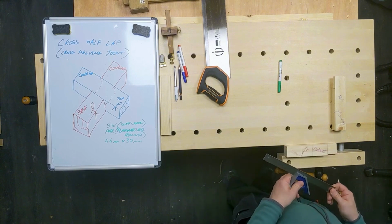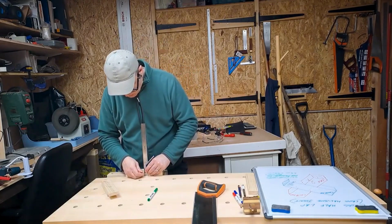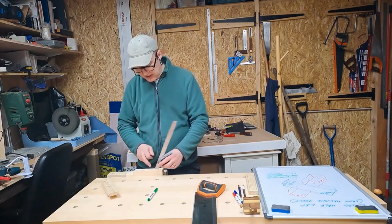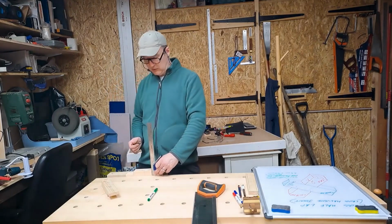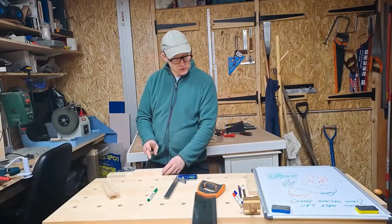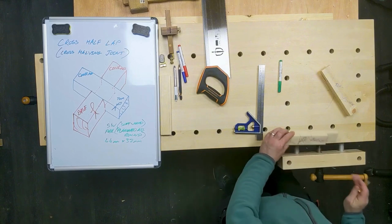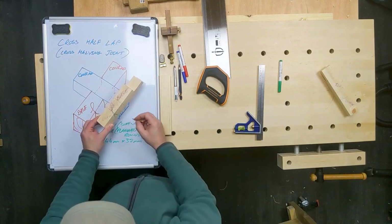Since it's in the vise, I'll leave it there. So you can see from the front that I don't have to move it around that much. And I want this to go just beyond halfway down here. The body of the combination square is on the face side now. That'll be halfway there, without getting marked. That one through there. I'll do this side on both of those lines. So it's this red one that's going to get cut out on the top. That's marking my waste. This bit's going to be waste. So there's our base. Gets cut out. That's the one that's going to cut.